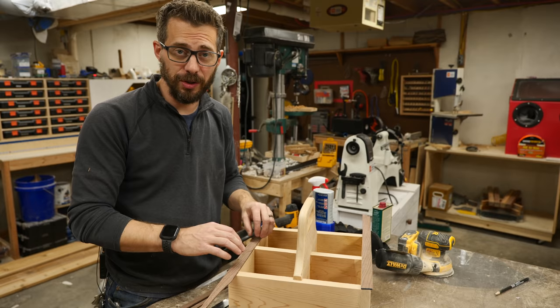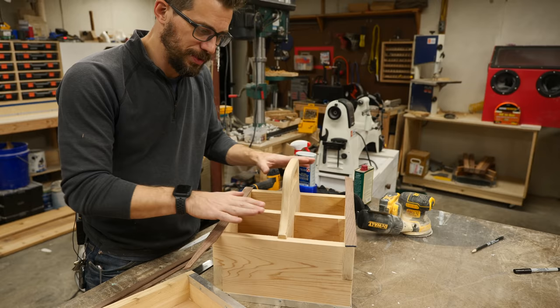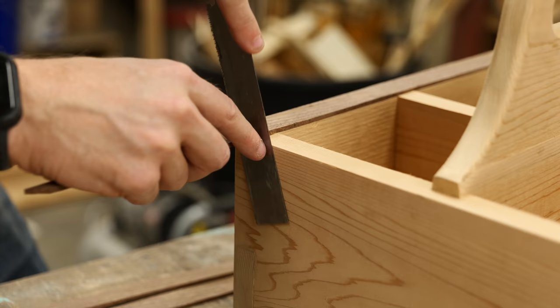I was sanding and I had it almost finished, but I think it needs one more detail. I'm going to take a cue from the tool cart that I showed you earlier. I cut some strips of walnut to put on the top surfaces. Now this is going to be decorative, but it's also going to protect the soft cedar as you take tools out and put tools into this thing.